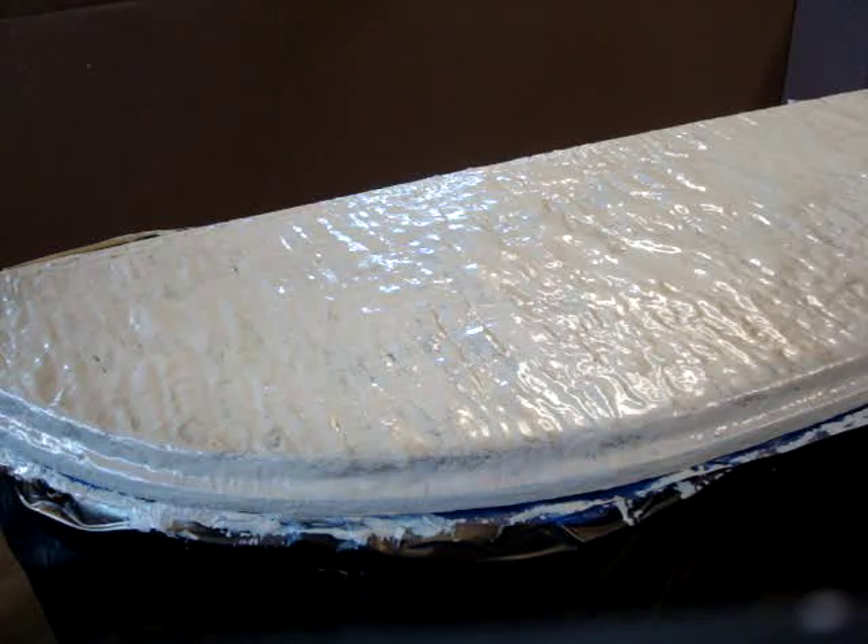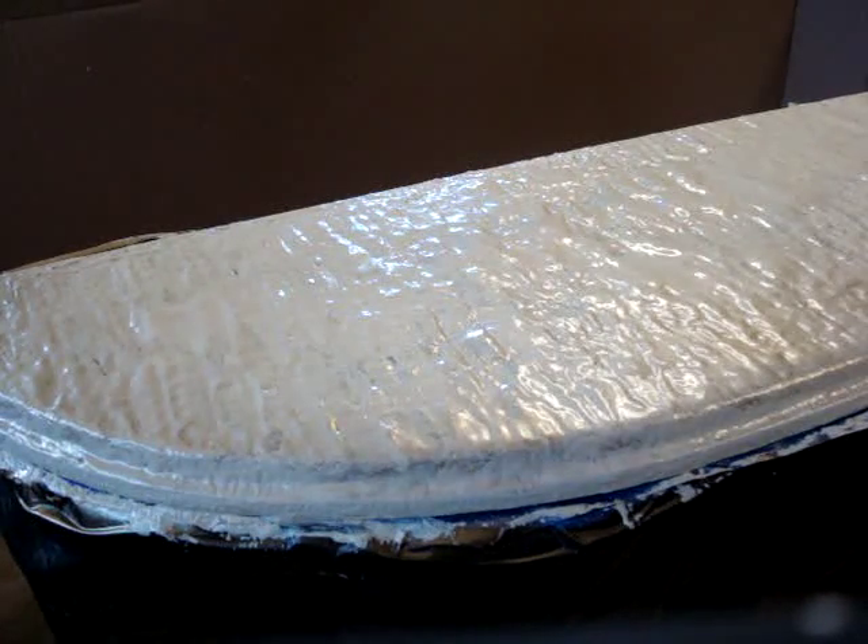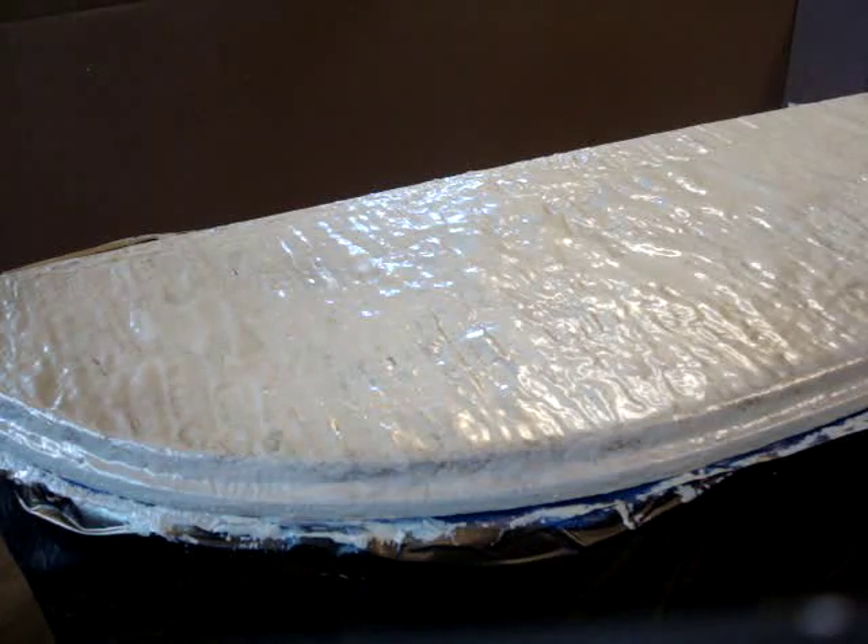Now just add one more thin layer of your spray paint. That's the icing on the cake — in just a little while it should be dry and crackling. Then we're only going to add our final glaze which is crystal clear, and this table is ready for the foyer. We are now two hours into drying and the details of the crackling paint are starting to come in. I went back along the edges, stood about 12 inches away, and angled the can upward so the paint would simply hit the edges around the trim.